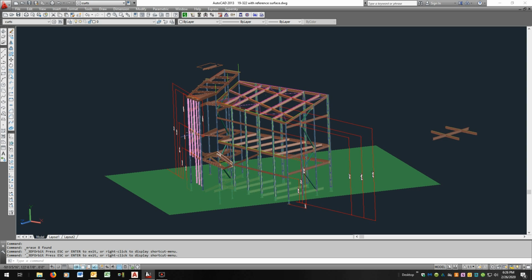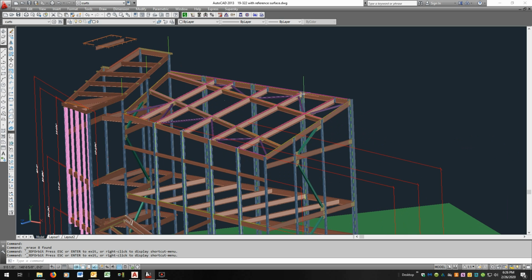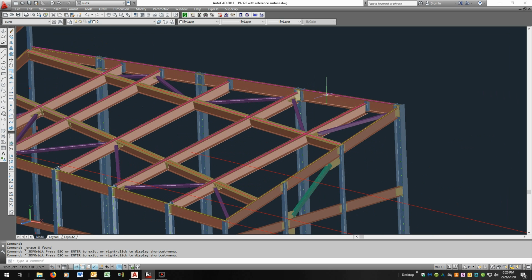To recap again, you've got the four knife plate connections here to fix. This plate here is an obstruction. Everything here is okay. We're going to accommodate what happened with the steel here. That should work. These five I-beams need to be rotated to the plane, and this tube right here along the wall needs to drop 2 inches, and those columns get cap plates flush with the beam at elevation 145.